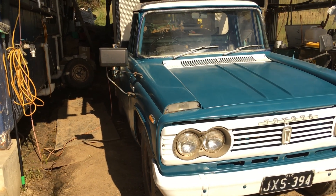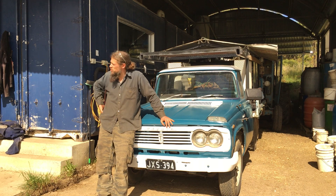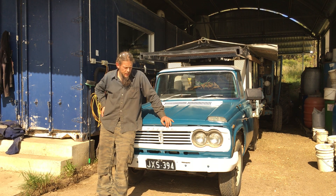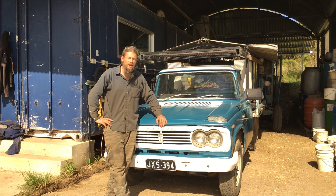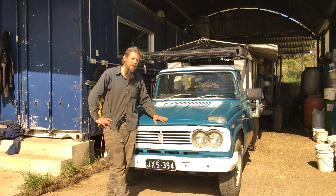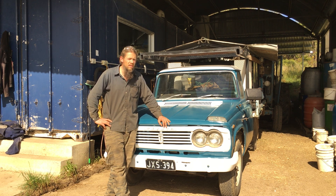Seven weeks ago I was standing here telling you about some of the reasons why we might want to convert this to electric. Short daily run out to milk the cows, less than a kilometre, solar power on the roof, plenty of spare solar — it doesn't need a lot of range and we were just able to gear it right down so that a small motor and modest batteries can do a great job. It does a lot of short little trips, a lot of reversing and slow speed manoeuvring, backing up to the dairy parlour, towing the parlour at low speed — it's a really amazing thing to not have to be feathering a clutch in really low gears and have all that torque. It feels like a really appropriate vehicle to do the first EV conversion on, and a little bit forgiving, because it isn't road-going and it's low voltage, so there's a whole lot of regulations we didn't have to comply with and yet we were still safe.